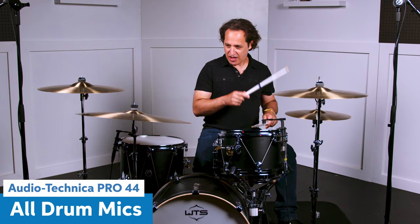The first mic you're hearing me talk through today is the Audio-Technica Pro 44. It's a low profile mic with minimum visibility. It's got a wide range condenser element with low mass diaphragm for superior performance and a frequency response of 70 Hertz to 16 kilohertz. From the back of the room, you're hearing the Audio-Technica Pro 44, with the same specs.